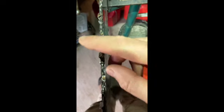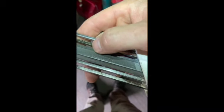You can either mark your starting tooth or count to 81 while you do it. You see the arrow pointing in the filing direction, and over here you've got the pictogram of the saw with the chain. Use two hands and run the file this way on each tooth. The teeth are offset, so you sharpen this one, then that one, and so on. When you've done one side, flip the saw around and focus on the teeth going the other direction, running the file accordingly.